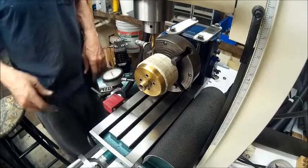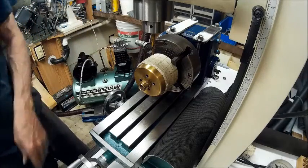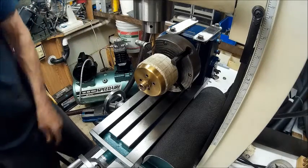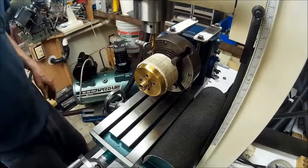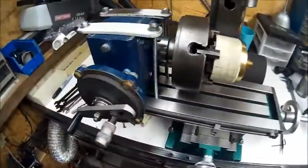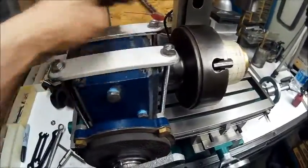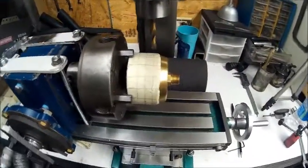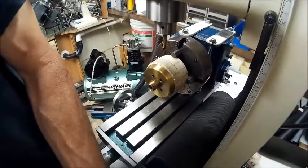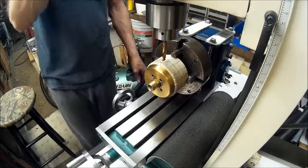We've got this indicated and what we've done is use the dividing head that I built — clamped it down to the table. I just made some bars and clamped it down with all-thread; it ain't going to move. Got my indexer ready to go, so now we're just going to worry about turns, not a certain spot. Let's get started.